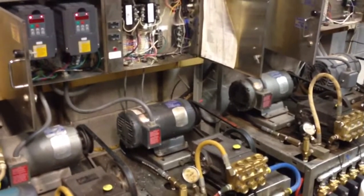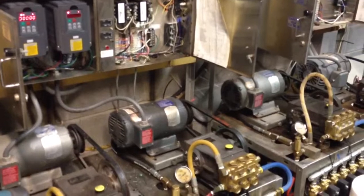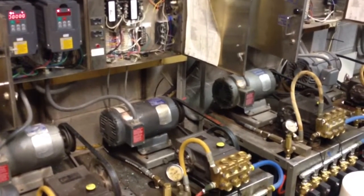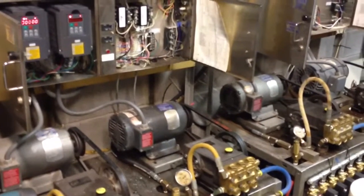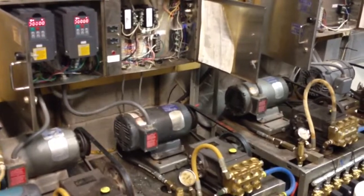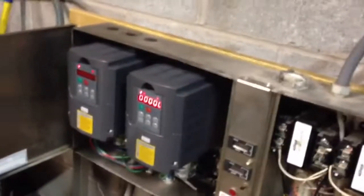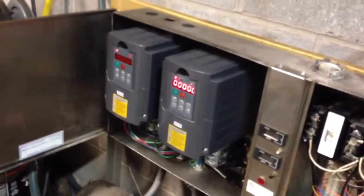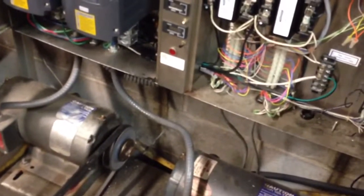What we found was that even on high pressure, we're able to slow down the motor to about 1400 RPM versus 1700 RPM and still maintain 1400 PSI out in the bay. So there should be some energy savings there, hopefully. I'll trigger this to show you — it'll start off in high pressure mode and purge, then switch down into low pressure mode. Just notice the RPMs it's running and how much smoother it runs than a traditional contactor setup.